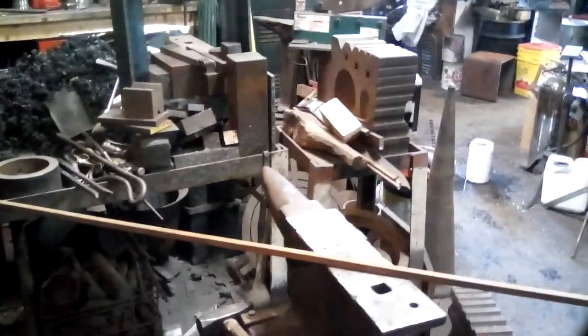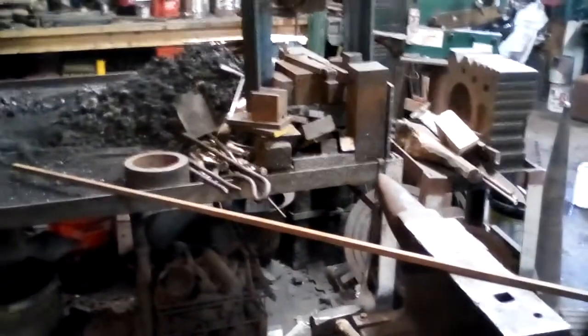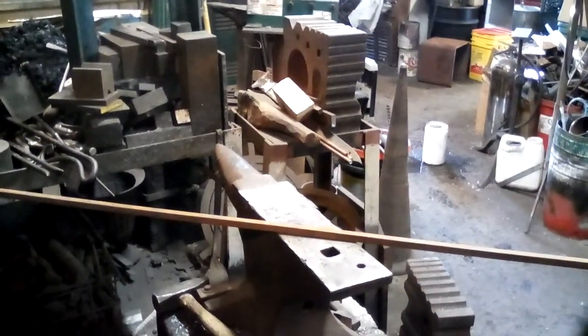And you take that measurement, set your anvil up, and then the railing on the forge should be at the same height. So if you need a little help with a long rod, keeping it from flipping out of the fire, or if you've turned it around and are working, you'll notice that that rod lies perfectly flat on the anvil.